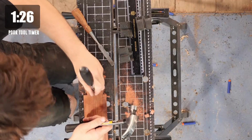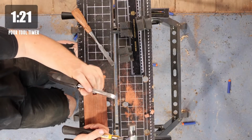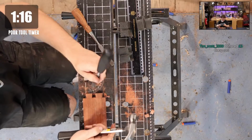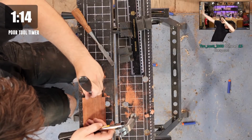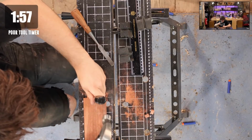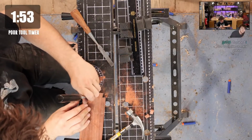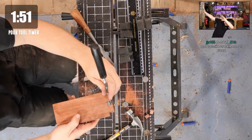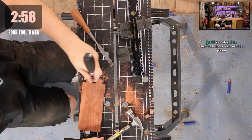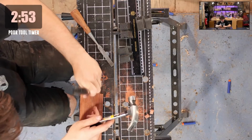Oh my lord, right. Okay, the other thing about these chisels is they're not bevel edged. Well, they are bevel edged. They have a bevel on the edge, but it is like 90% flat. And so getting into the corners of these dovetails. Tim has donated. So basically, because these have square sides, I'm having to angle the chisel like that to get into the bottom of the socket. Because if I went in straight, then that square edge of the chisel is going to bruise it.